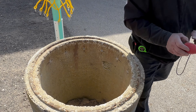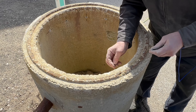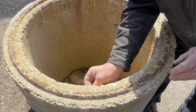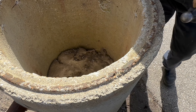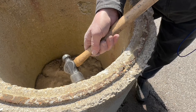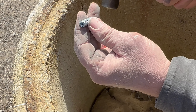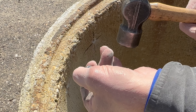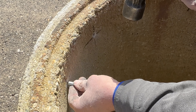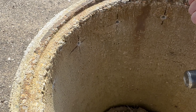We're going to add the inserts now. Most of them will just push in, but some of them you might have to tap in. The knurled end goes in. You can see it's split — it has a little wedge shape driver in there that will expand that when we get the tool out to set them.